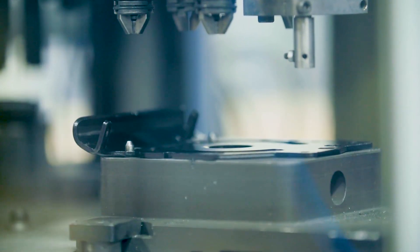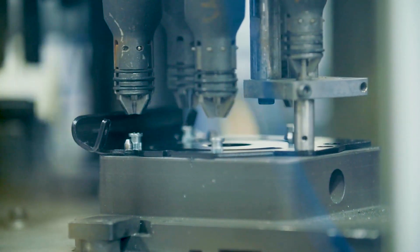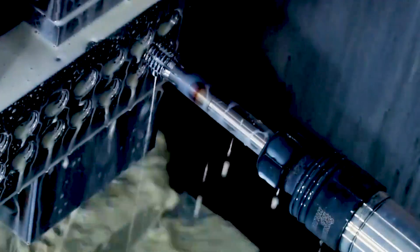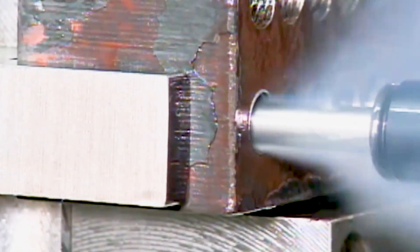With automotive, they are heavily invested in their production. One thing especially with metalworking high-production, high-volume shops is chip evacuation. If you cannot evacuate chips quickly — automotive likes to pump things in and out really quickly — and if you can't get the chips out of the drill, end mill, or tap efficiently, it becomes a really big problem. Tools start to break. A lot of our automotive customers have started to adopt form taps, where there is no chip, so there's no risk of breaking a tap or chipping out a tool because of improper chip evacuation.